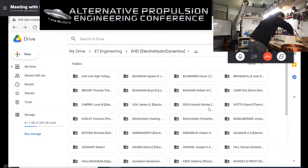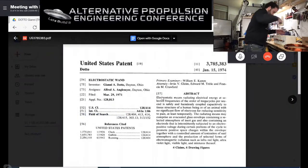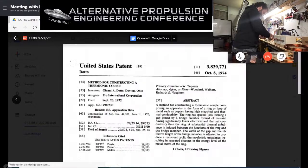As long as your incoming winding is not close to your outgoing winding, then you don't have an arc over problem. But you need to create physical space, and that means you have to wind it on the bobbin. There's no way around it. You have to wind it on the bobbin, otherwise it's going to cross over at some point and be too close. Right, that's what I was talking about, when you get that bobbin done correctly. Mm-hmm.